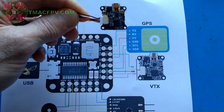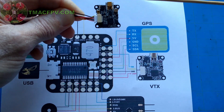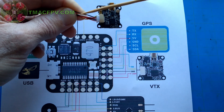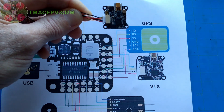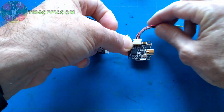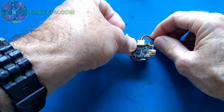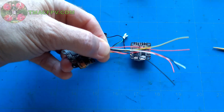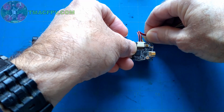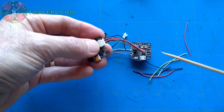For an overall cleaner build, what I like to do is measure the length of my wires before I actually solder them on to the flight controller. So before I connect this VTX with these wires to the flight controller as depicted in this diagram, I'm going to measure the necessary length of these wires and cut them to length for a cleaner build. The way the VTX is going to sit on top of the flight controller — these wires don't need to be all that long. With just a spacer in between, the wires only need to be about that long. Of course, you want to make sure you have enough wire — it's better to have too much than not enough. Then I'll go ahead and tin these wires and solder them up to the flight controller.